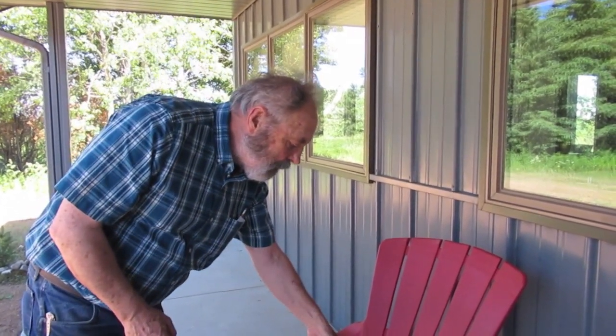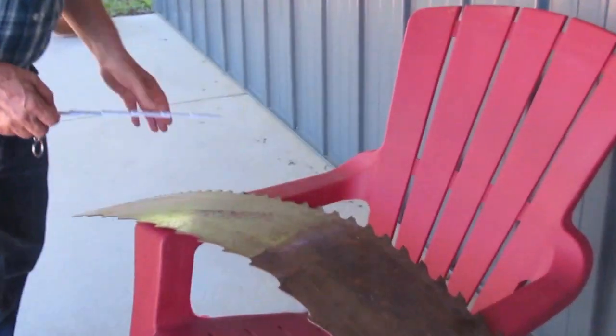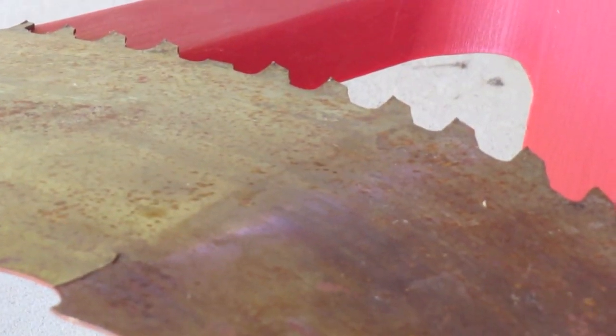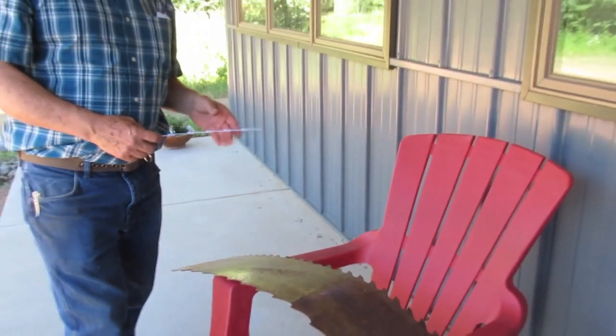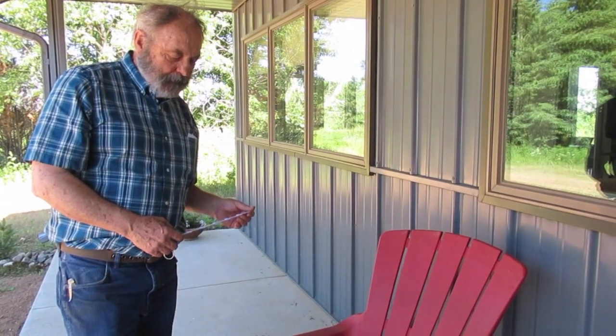These days, in commercial mills, these would all be carbide teeth and everything would be sharpened mechanically. Whereas in the old days, these were all sharpened with some sort of filing process, and swaged by hand. Is it a special hammer for swaging? Yeah. And there's no anvil behind it — you just use the rigidity of the blade? Well, there are special tools. I've got a couple of old catalogs showing all the different tools that were used in sawmills. Thank you very much for answering our questions.